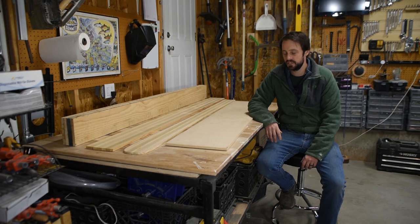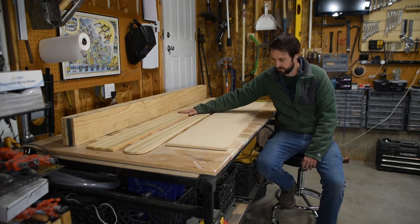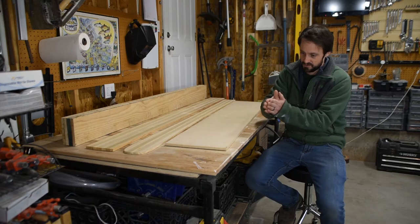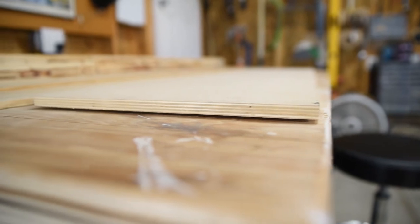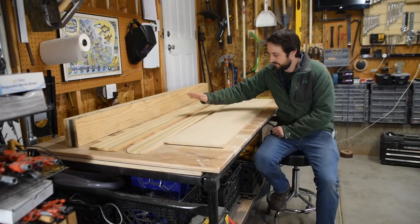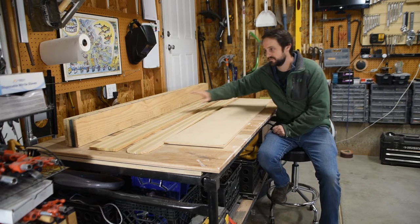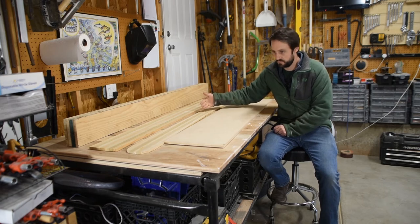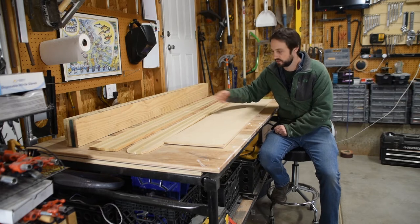There's two laminating types: horizontal lamination and vertical lamination. Horizontal laminate is simply like plywood. Take a bunch of thin veneers, sandwich them together, glue it up. All the interfaces are horizontal with respect to each other. So there you go, horizontal laminate. And then you've got vertical laminate. That's where you take a bunch of strips of wood or a big block to create a wood core that has vertical interfaces between each adjacent piece of wood.